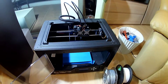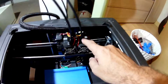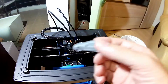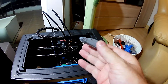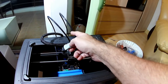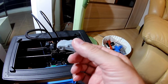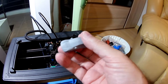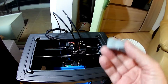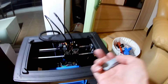What we're going to talk about today is the feature of the printer — specifically that it's got two printheads, the left one and the right one. When you're printing something that's a single color, you tell the software to use the left one or the right one depending on which spool is loaded. But when you're doing a two-color print, your model has to be designed with two-color printing in mind, and you have to set up the two desired colors and tell the software which extruder to use for color A and which for color B.